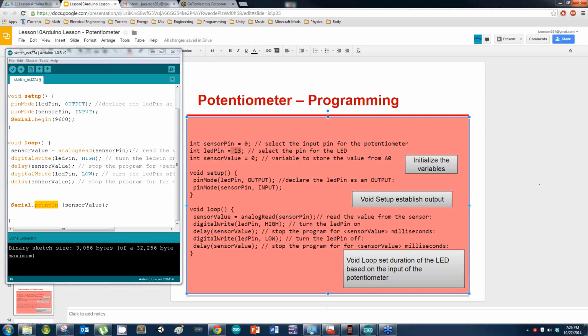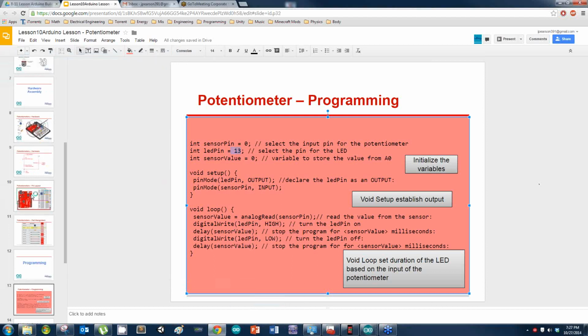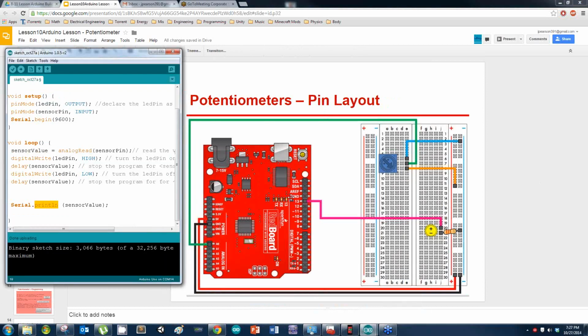The wire closest to the LED is going from J20 to A0. Alright, well, that's your problem. Alright, so let's look at the circuit again. Put this back up. Alright. So you're telling me you got this wire here plugged into A0. The wire that's going to the LED, you got plugged into A0? Oh, yeah. All right. Then that's your problem.